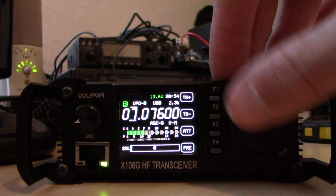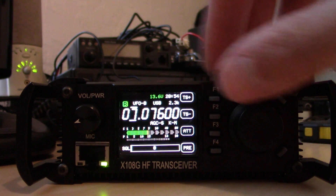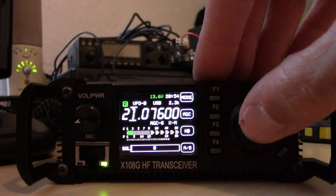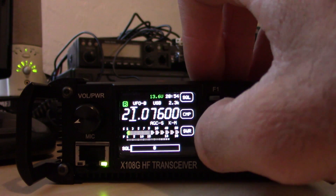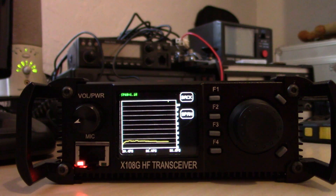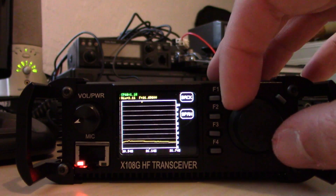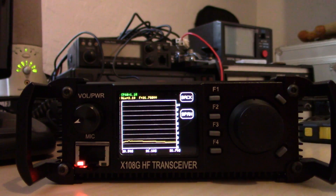Let's go to 15 meters. There's 15 meters — at the 21 MHz CW portion, going up to the phone portion, coming down a bit... I'm around two to one. I'm not sure how accurate that is because I have to run it on the analyzer, but we'll check that out later and see exactly how accurate it is.